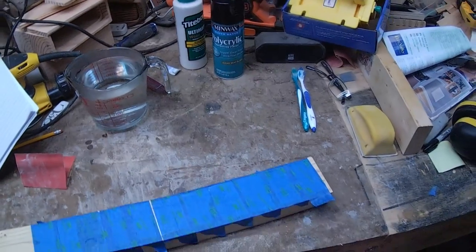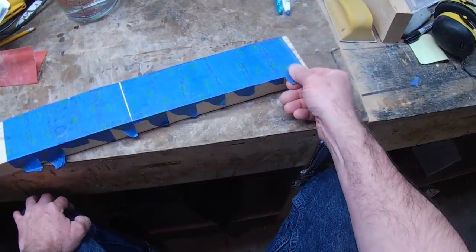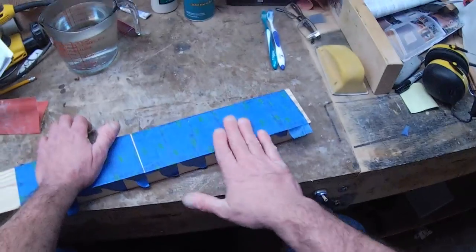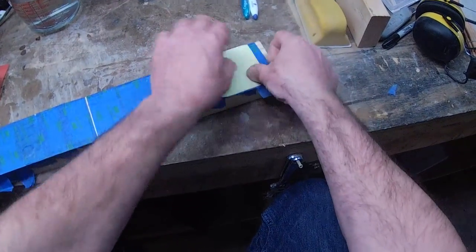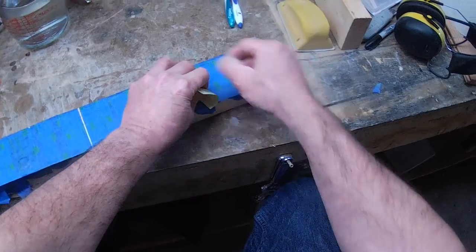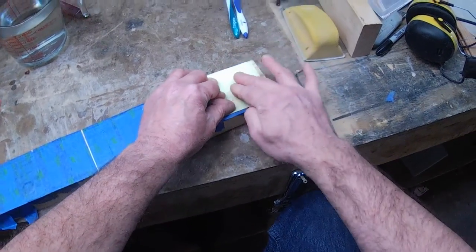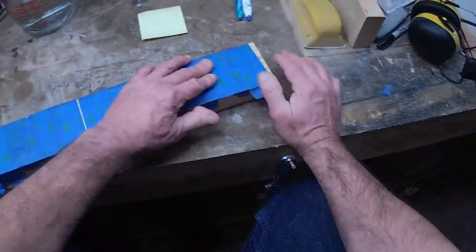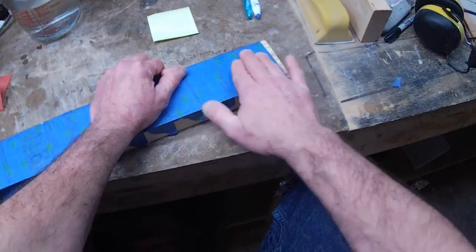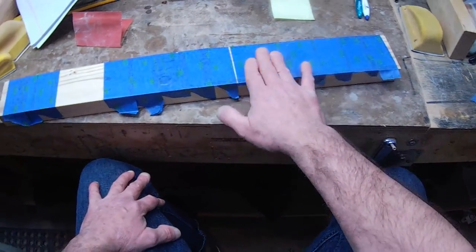His most preferred method uses a water-based polyacrylic product for finishing wood — clear semi-gloss. You essentially spray that onto the surface of the wood, which should be sanded and free of dust. Then you take the print, put it down, tape it, flip it up, spray the area, put the product on, place the print down, mush it down with your hands making sure it doesn't move, then burnish it in with a credit card or a smooth piece of wood.